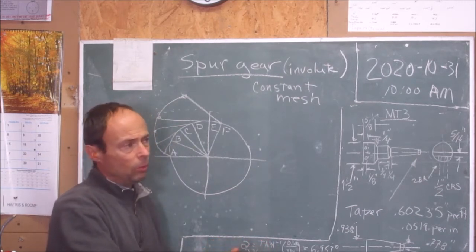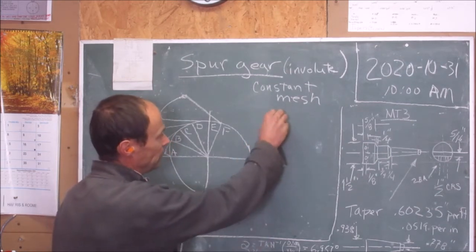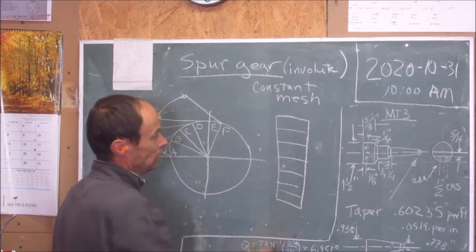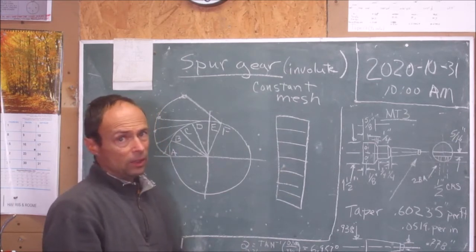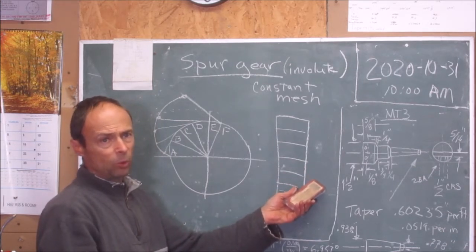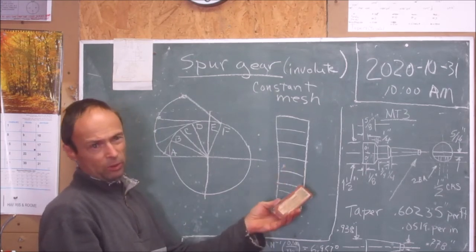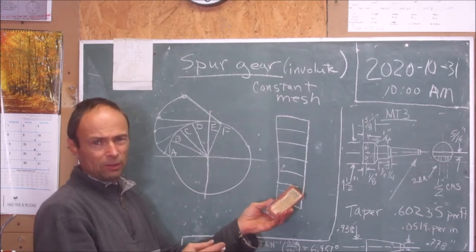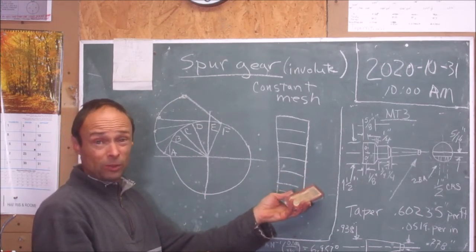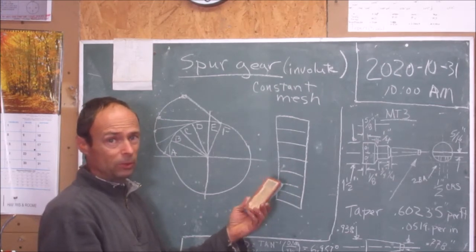As far as gears go, the spur gear is a straight gear. If you look at it sideways, it's like this. Okay? And that's a straight spur gear. These are noisy. They're not made for high RPM or constant use like in an automobile. Like the old cars from the 1920s and 30s, 100-year-old cars, they had straight gears in there. And so do older tractors. But when they start humming down the road, you can hear those gears humming.